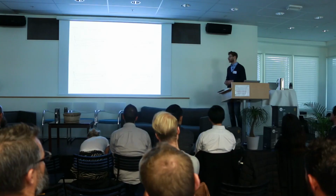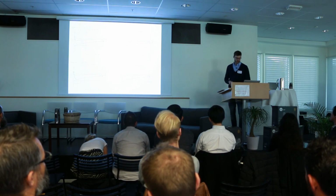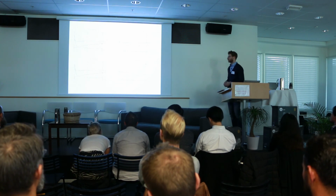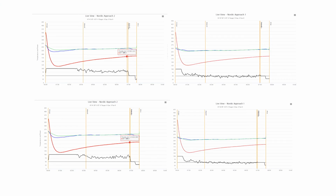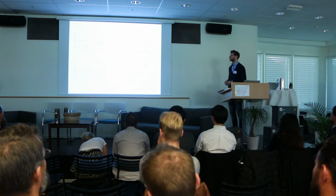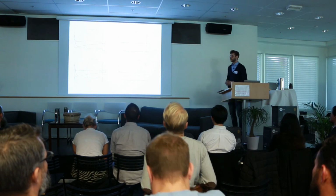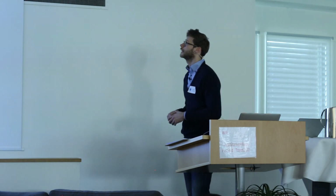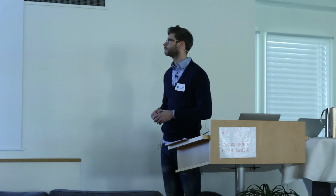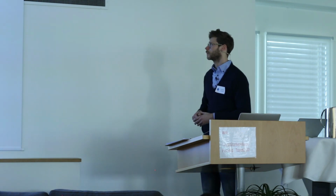So what we experience is basically that the most even roast we get is when we're doing automatic roasting. This is a profile from an automatic roast. Mind you, we haven't really fine-tuned the machine quite yet. We're still working on getting the maximum out of our temperature sensors, which is absolutely critical for this type of application. But what you'll see is that we're trying to follow the green line, and the blue line is what we have measured. Then you have the gas percentage going up and down accordingly, trying to compensate for the error, as we like to say.